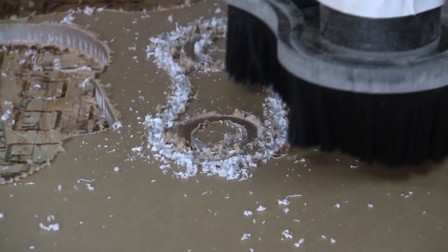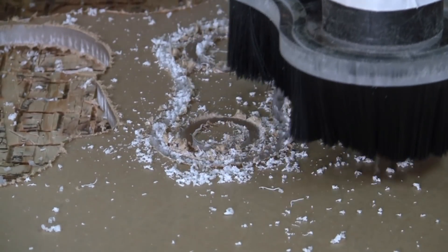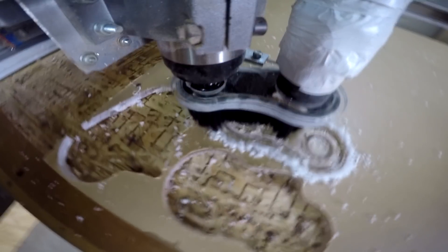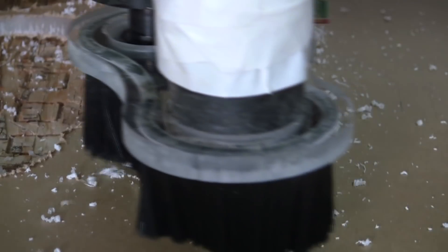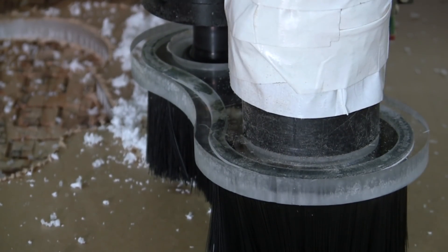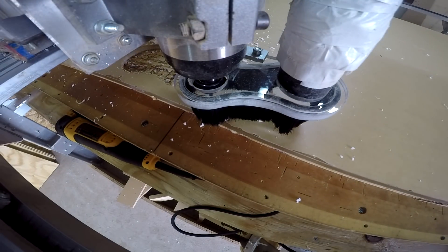That's probably gumming up. What do you think happened where it stopped and had that vibration? I think the depth of the cut had a lot to do with it — it was removing too much material. If you go faster there's going to be less heat causing that gumming up. So we weren't able to get through the entire piece because it didn't cut the profile correctly, and we're going to have to start a new one.